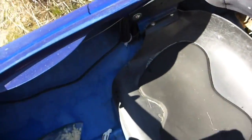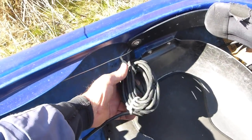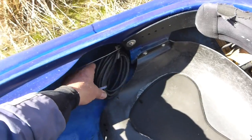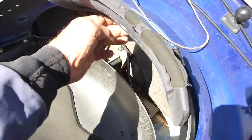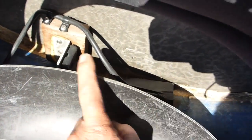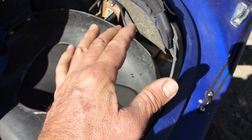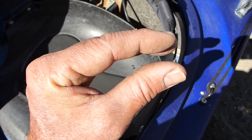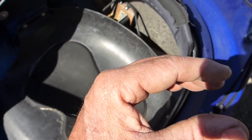The fish finder is wired in — I'll show you there. One of the downsides to a fish finder is you can't cut the cable and splice it shorter; it won't work. So you have to carry this big bundle of cable, which is not ideal, but you tie-wrap it up and shove it back in there. You can see the transducer right there, mounting to the bulkhead so that the transducer is about an eighth to a quarter of an inch above the hull. With a little bit of water in that area, it acts as an acoustic coupler and shoots its signal right through the hull.